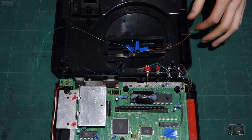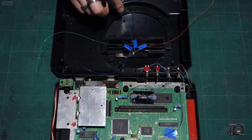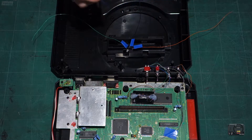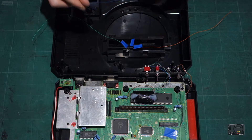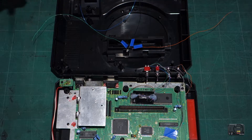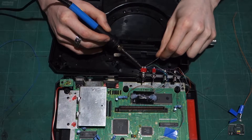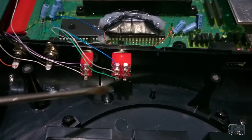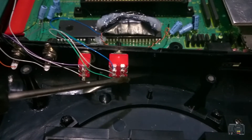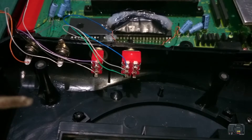Okay guys, so once you've finished prepping your LED, what we're going to need to do next is attach our green and orange cables to the switch, and we need to attach one end of our live cable - I'm going to be using a blue cable for that. So we're going to be using blue for our live. What we need to do obviously next is apply some solder to our switch and then get these cables in, so let's go ahead and do that. There's our points done - we want to be attaching our green cable to the bottom one, our orange cable to the top one, and then putting one end of our blue cable which will carry our live signal into the center.